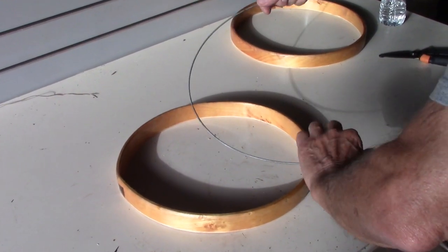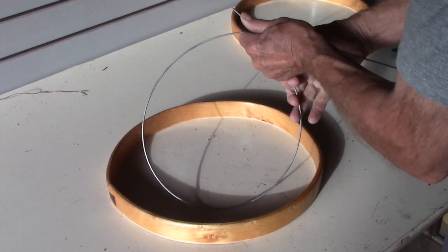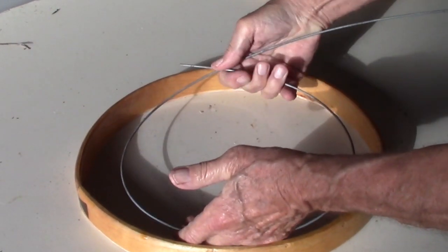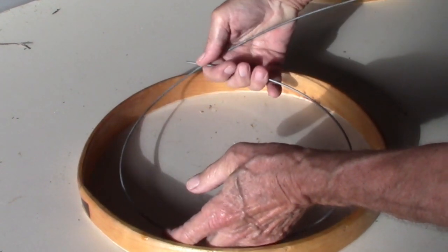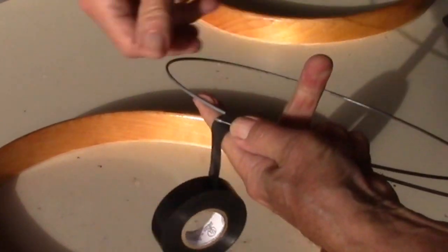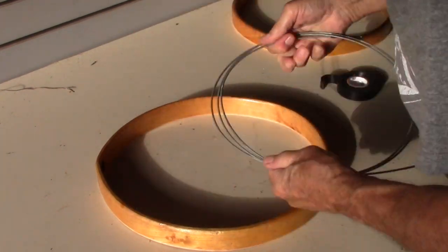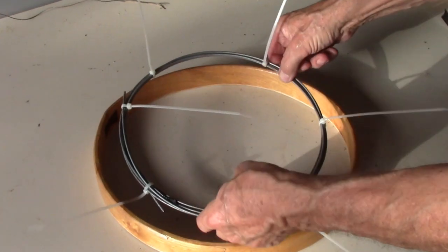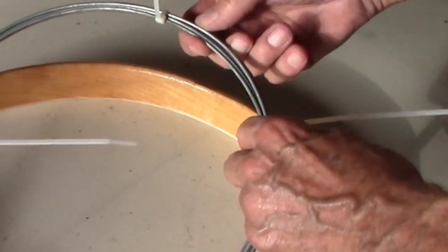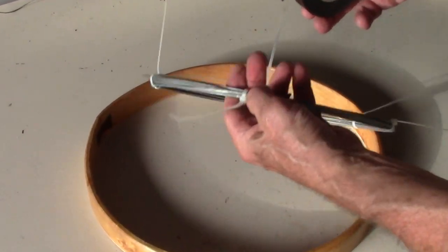Because this is springy, I am wearing safety glasses. The hoop is made from 14-gauge fencing wire. I want the hoop to be about an inch clearance all the way around. After you make a coil, I'm using zip ties to hold the wire. It's a hardened fencing wire, so it doesn't bend very easily.